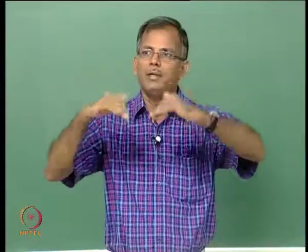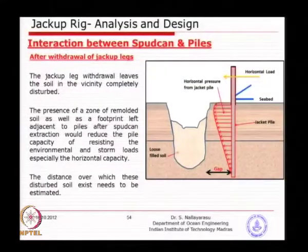Over a period of time, the soil will slowly collapse from the sides. When the soil is collapsing from the sides, when originally it is 20 meters in diameter, the diameter at the surface will actually increase because the soil keeps on collapsing. By doing this, the distance between the collapsing surface and the pile slowly reduces because the soil is trying to collapse. Some amount of soil will get settled and form better behavior, but still near the surface you will see a big opening.